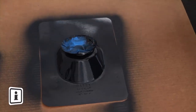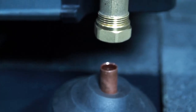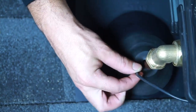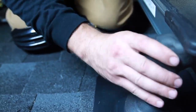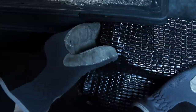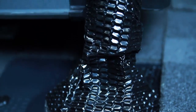Note: since the flashings are silver in color, it's recommended to paint the flashings with a high quality roof flashing paint. Slide a piece of half inch copper up through the flashing from inside the attic and connect to the compression elbow. Note: please do not solder the half inch adapter ring to the copper pipe. Now slide the end of your sensor wire through the flashing and into the attic. Cover the pipe and elbow with a high temperature insulation. To finish the connection, we recommend covering the insulation with FlexFlash ST made by TRA-MAGE. Simply cut the FlexFlash to desired length, remove the backing on the butyl adhesive strips, wrap it around the insulation and form the FlexFlash so it securely adheres to the insulation and the pipe flashing, creating a watertight and long-term seal. Repeat the same procedure for the lower left-hand corner.